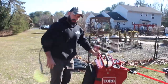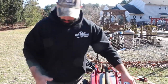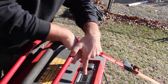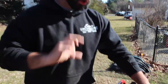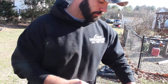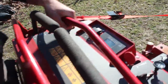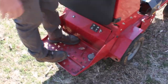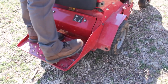I'll show you how we engage the tines on this machine. It's a Toro Grandstand, 30-inch. To engage the tines, there's a button right up here on your dashboard — simply press it down until the little black lever disappears. Once that happens you can adjust your settings. Right now it's set at two and a half inches, but I'm going to increase that to three inches so you can get a better look at the core. It goes all the way up to five inches, so you can pull a five-inch plug with these tines. Once you're all set, press the button down by your wrist to get your tines going.